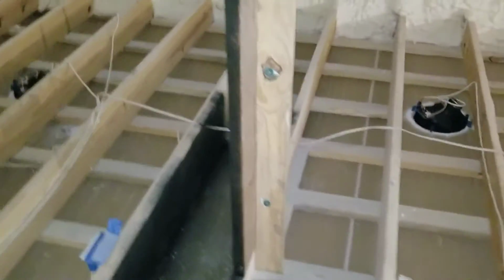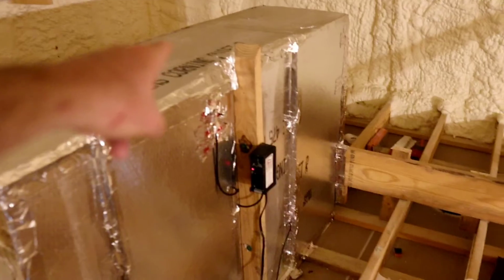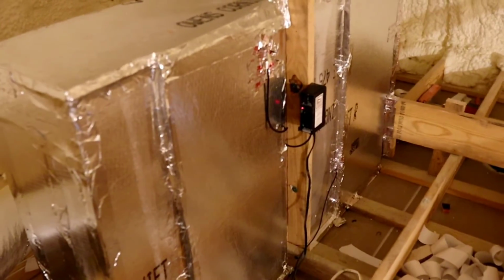It's very, very strong. If you had any type of wobble or kick when the TV goes up and down, see, it's very, very sturdy, but you could just put a kicker, is what they call it, off of here down to one of these other joists just to stabilize it this way. But it's very, very stable as is because of the lag screws that I use. I'll put a link to those lag screws in the description. The kind I use are really, really good.